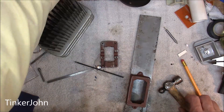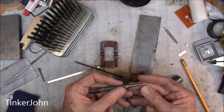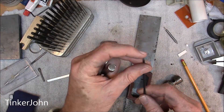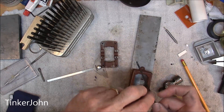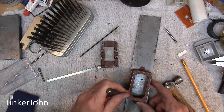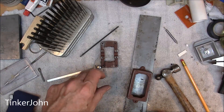What I'll do now is bring this up with a center punch — this is actually a prick punch. A prick punch and a center punch are two really different things. The prick punch is just for taking the point, because this just barely made a dent. I don't want to ruin these, even though they're hardened. All I need is just a slight, slight pimple in there. I'll take the prick punch, find out exactly where that hit — it falls right there — and then tap a little bit harder on that one. Now I've got that one in.